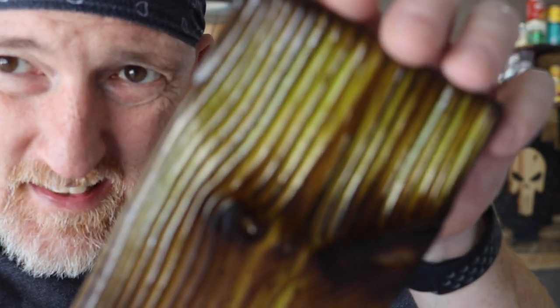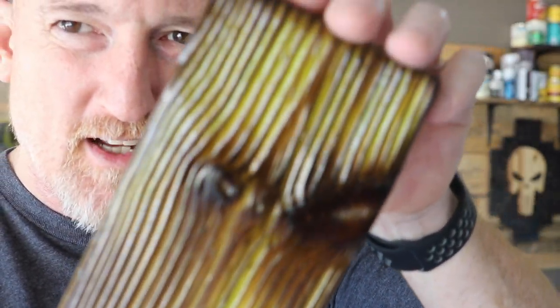The last two are dye as well. I've been trying to get this to work right for a while. So this is the green, and every time I've used this, it comes out kind of a yellow color. So what I did is I really let the dye sit on the wood, and I finally got more of a green result. I really like the way that one turned out. And last, but not least at all, because to tell you the truth, I am just not a big fan of the color yellow, but look at how badass that looks. You could attribute that to the fact that yellow's the closest thing you have to like an actual wood color. So it really kind of brings that out and just kind of makes it almost an unreal real. Can I say that?